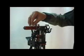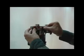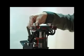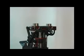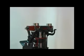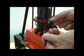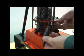After the powder bushing is installed in the charge bar, thread the screw back into the front of the charge bar. Once this is completed, reattach the spring to the spring anchor. Once the spring anchor is attached, move the charge bar from the right to the left and raise the bar lock so the bar is in the locked position. Now we need to install the primer seating assembly, which consists of a post, a top, a spring, and a spring pad.